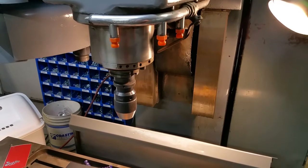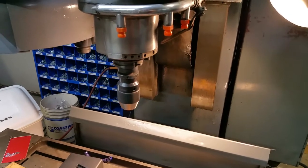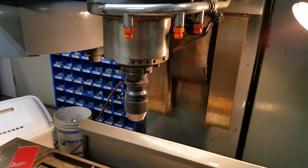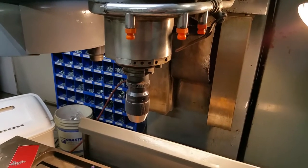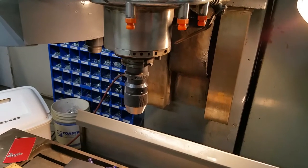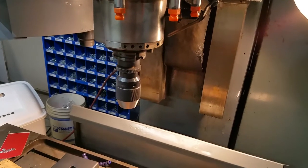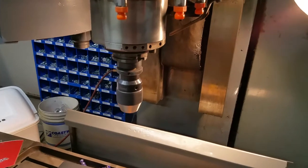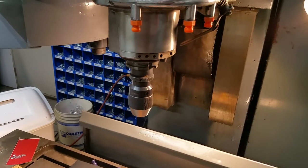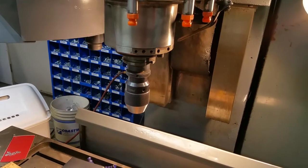Now there's a lot of linearity on the higher RPMs, and down at the lower RPMs, because of the bias offset, there's a slight non-linearity — but it's within 100 RPM at worst case. I can do a little over 5,000 RPM — about 5,175 in the middle range — and I can go down to 200 RPM in the middle range. For most of the machining I'm going to do, that's a pretty good range, and I won't have to be moving the belt around. The more important thing is that I can get good torque throughout the range.